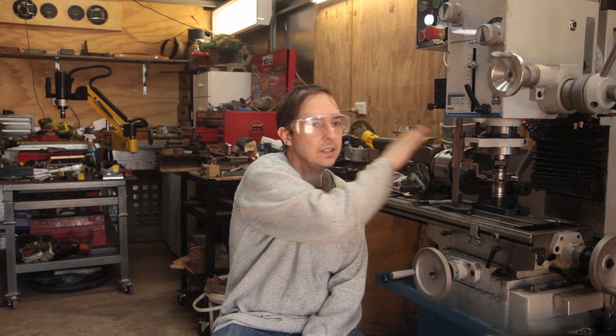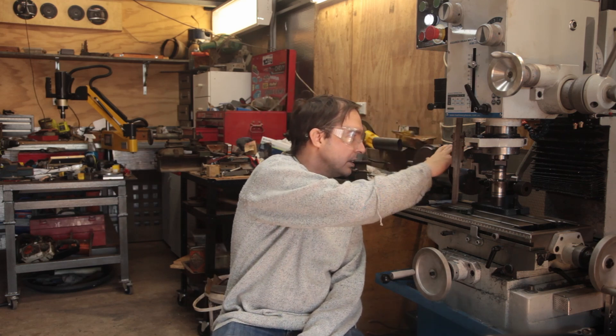Welcome back to Docs Off Topic. Today, as you can see, I'm gearing up to do some gear cutting. What I've got here is the 100 tooth blank for a transposing set for the South Bend, because I need 70 millimetres worth of M8 trapezoidal thread, and the only real way to get that accurately cut is to single point it. So hence I need metric gear cutting in an imperial lathe. Join me as I cut these gears.